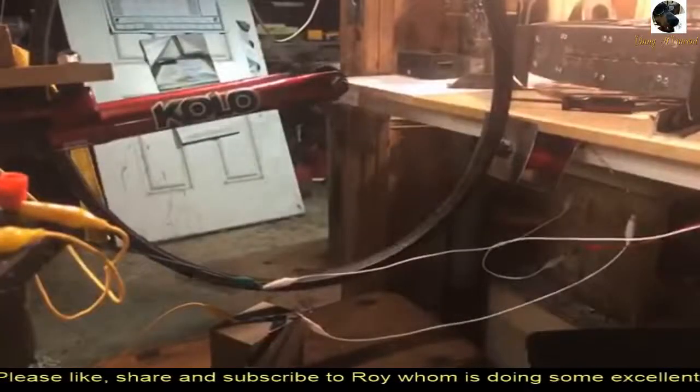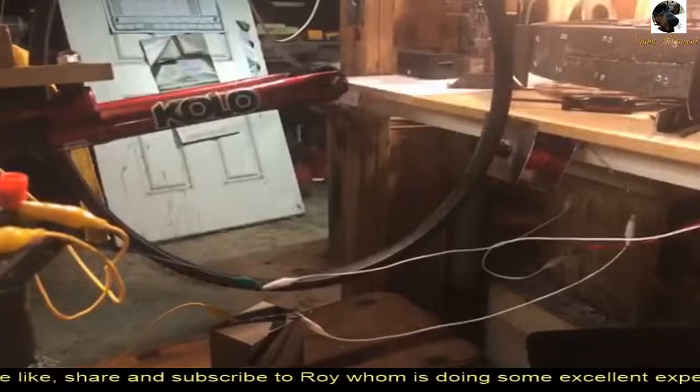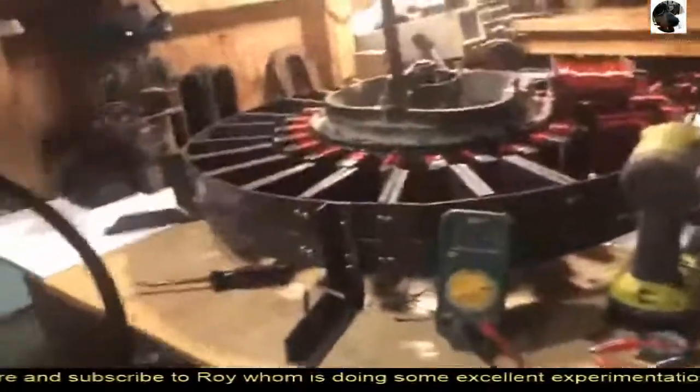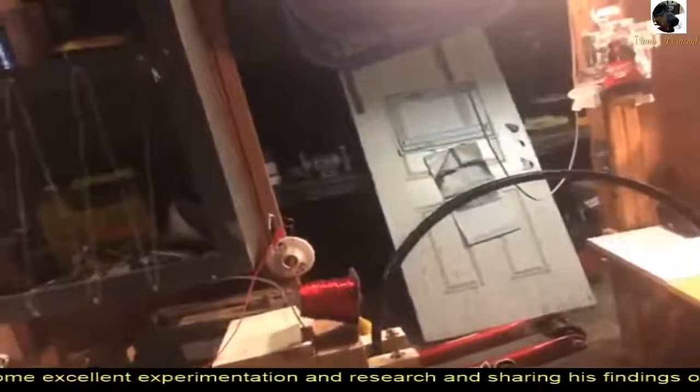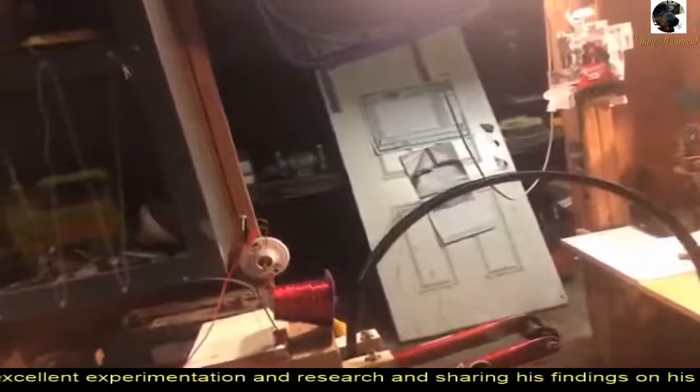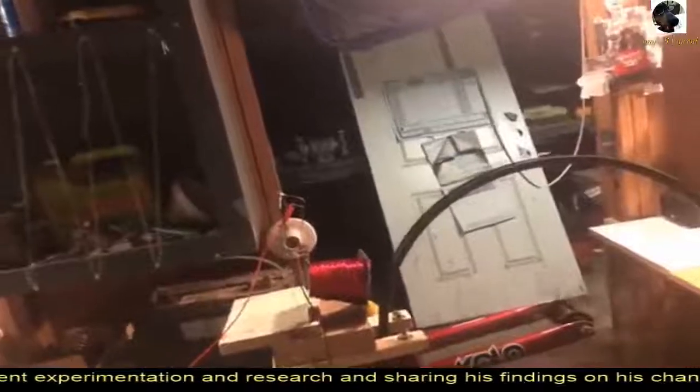It's the current. Voltage is one thing, but voltage doesn't mean you have the current. So the current it takes for this battery to drive them two coils takes good current. And I didn't do the math, but 300 turns, 2 coils. I think I'm at 12 volts. I think I'm at 19 amps is what I'm pulling.